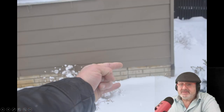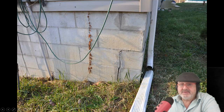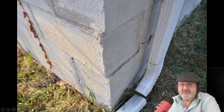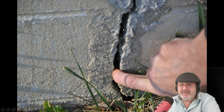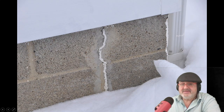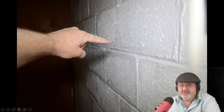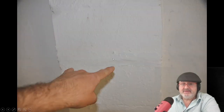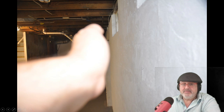You're always looking for these cracks on the outside, usually on the end, but sometimes behind the gutter, about six inches. Sometimes they actually have differential, and this thing's going to leak into the basement too. The gutter's actually causing differential — it's leaking into the block, going down the block, and getting soft because of water. They patched it at least twice. That crack near the end — it's not shrinkage, it's soil pressure. When you see horizontal cracks, they're usually at chest height. They're trying to hide it, and it opens right back up.